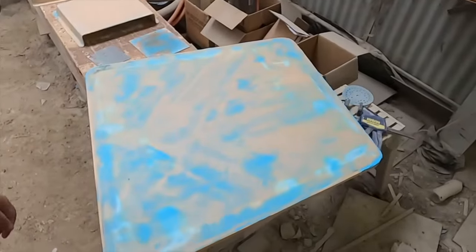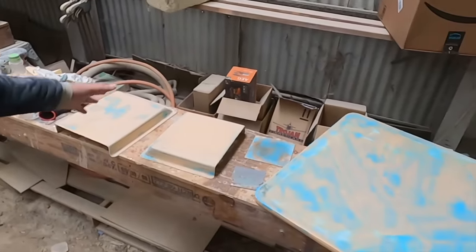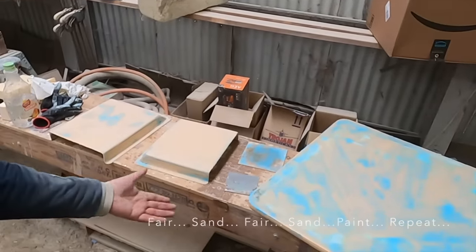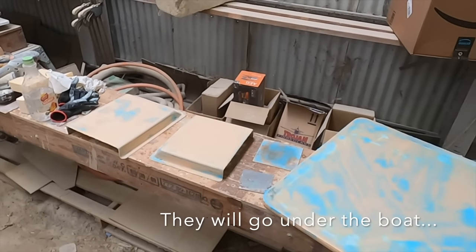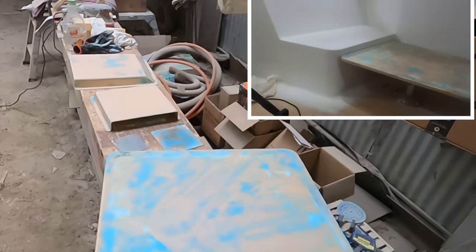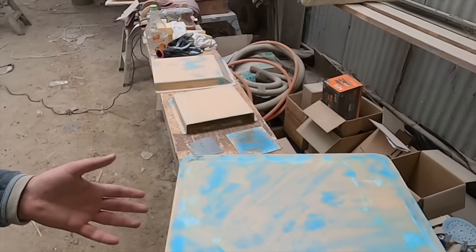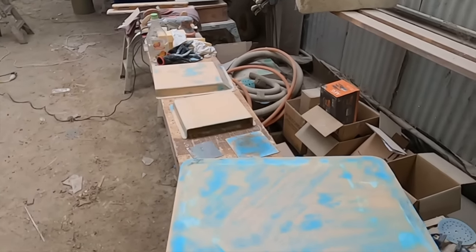Back for another round of fairing on these. Nothing is faired in one go. What I've done is made these pieces and put one layer of fairing on, sanded that down, painted it, sanded that down, and now I'm fairing again. I'm not fairing these particularly well because I don't need to — this is a table and it'll be in the cockpit. I'm fairing it with epoxy fairing compound again this round, and next round where there will only be small imperfections I might use car body filler.